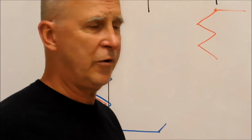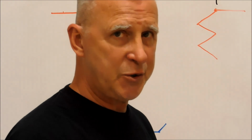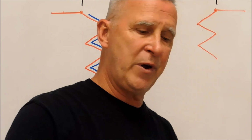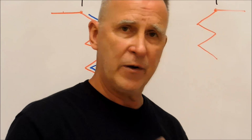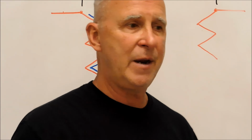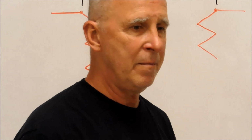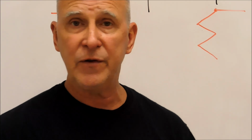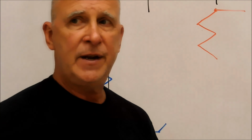Now you're going to say, okay, well, great, now I've got to pick them all out. Actually, they're still connected. You've just created a spring. And if you wind a spring counterclockwise on a right-hand screw, it shrinks and it makes it a lot easier to pull out. And that is the technique that I've used for many years, and I've never failed to get one out. Knock on wood, right? So that's the technique that I'm going to use.